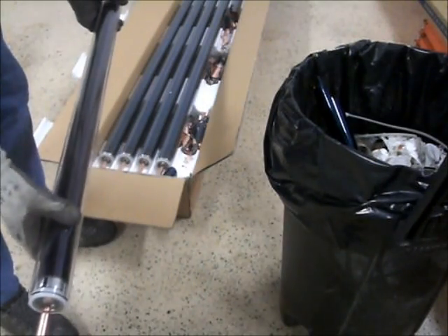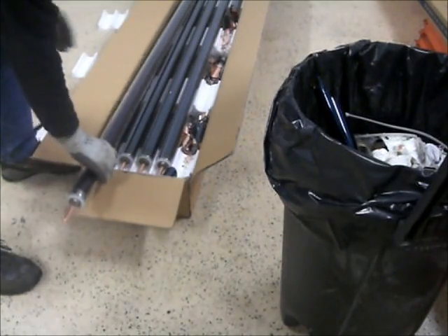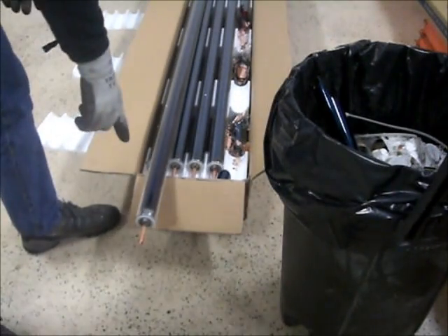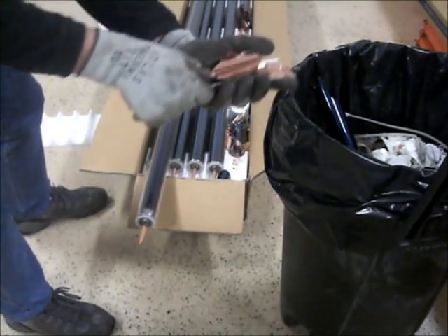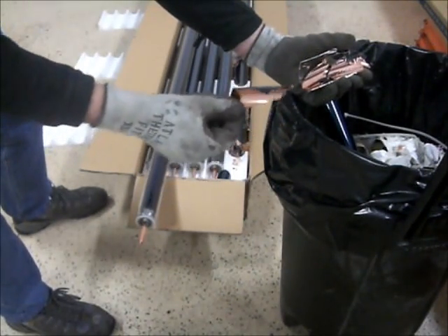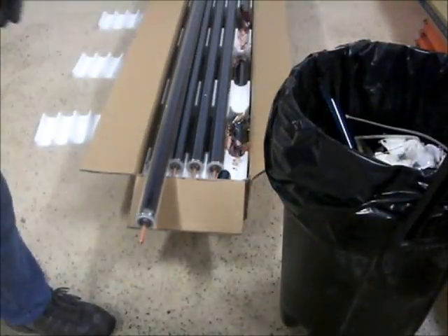All we needed to do was buy the replacement pipe, and those are quite cheap. So in case of hail damage or anything like that, you can always save those copper heat pipes and put them back into a new glass. You can see the carnage there — the clear is the outside, the coated one is the inside glass. Normally there's a high vacuum between the two pieces, but if you get a broken one in shipment, they are repairable.